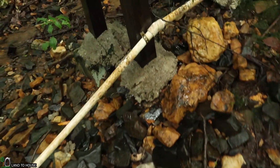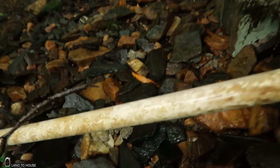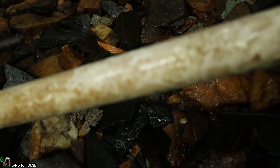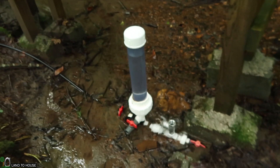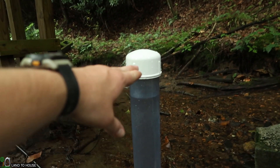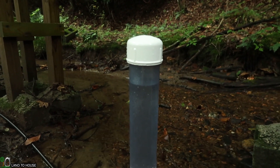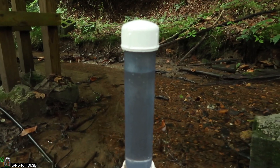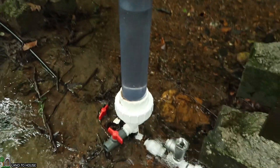It's beginning to happen here. If I come over here and listen to the drive pipe, it's starting to hit really hard. Basically, eventually the water will be all the way up into the cap, and the air itself will have absorbed into the water and gone away. And the pump will just continue to hit harder and harder.